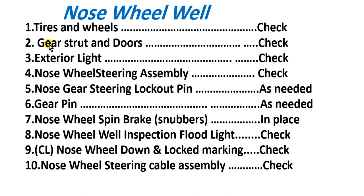Also check the nose gear steering lockpin. Take care — this is a dangerous point. The steering lockpin, also called the gear lockpin, must be checked. Also check the nose wheel shimmy damper, which is in the ceiling of the wheel well.